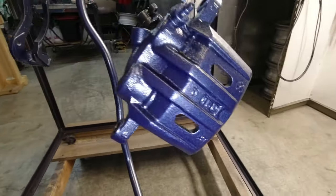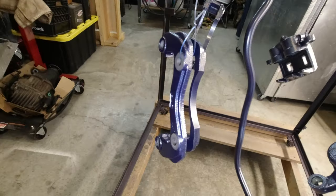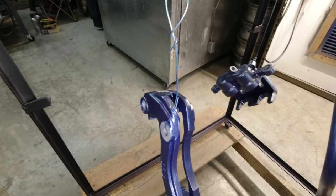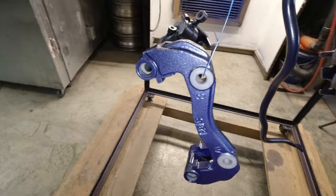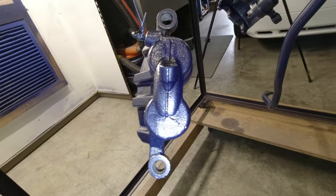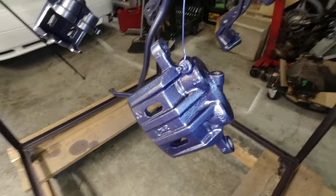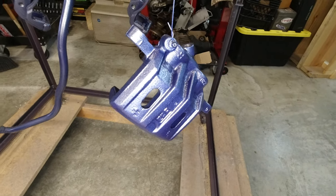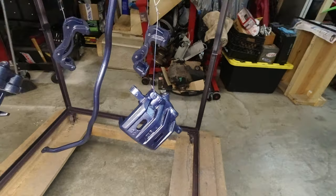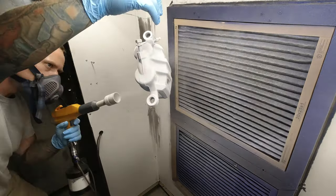Here's the Illusion Royal after it has been brought up to temperature and then pulled out of the oven. It's just kind of a silvery blue — sort of a weird color right now. But these Illusion colors activate when a top coat is applied. I'm going to be spraying a flat clear coat over them, though a gloss clear coat could also be used for a very different result. Here we go with the flat clear coat — it's called Casper Clear from Prismatic Powders.